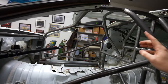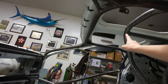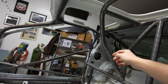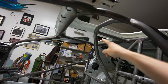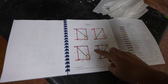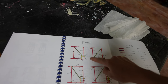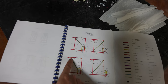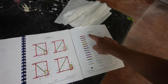Now all of that is tacked in — just need to finish welding all of it. I think the last part we've got to do is the diagonal bar off the front bar over to the cage, and then as long as my helmet can't fit through there, the only other thing we need to do is put some flat strap up here. The last main bar we've got to put in this cage is bar number 37 — one-inch 049 wall chromoly is what we need to use for that bar.